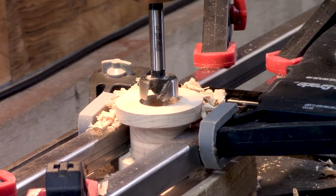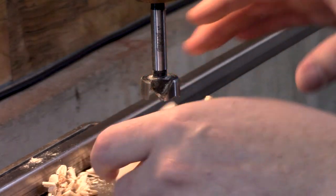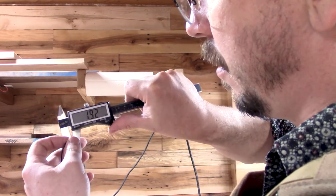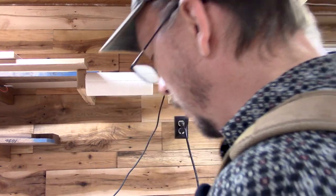I believe I've made it all the way through to the bottom. I've removed the clamps and now I'm going to see how clean this hole is — and look at that, isn't that nice! Now per the original design I wanted to make a small groove in the spool where the wire can sit through. I measured the wire at about two millimeters thick, so I need to make that groove about two millimeters wide. I'll do that on the bandsaw. Originally I was only going to cut through one side of the spool, but since I put it all together without cutting that line earlier, I'll do it now — it's probably actually a better idea to do it at the end so everything lines up.